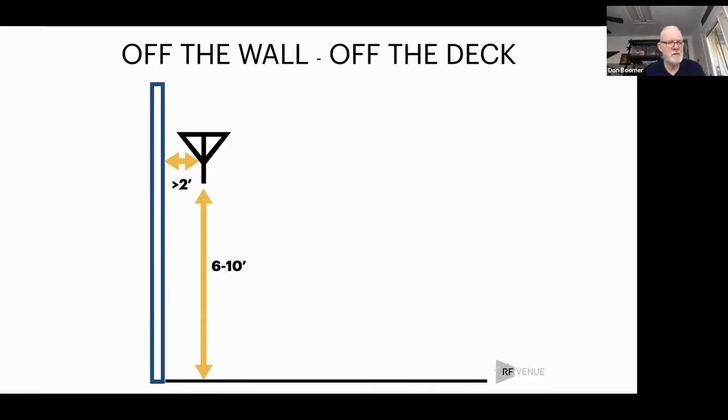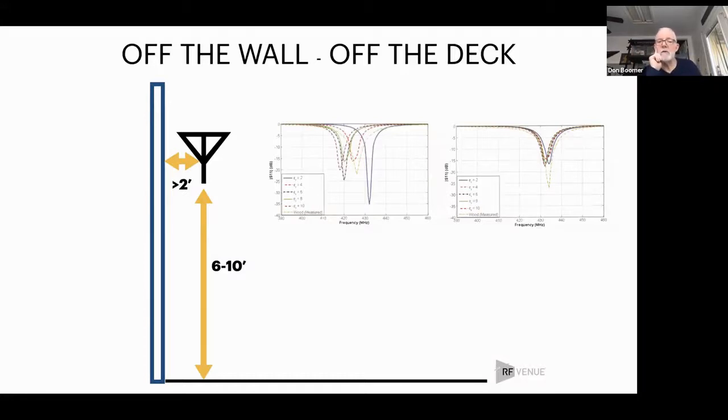The most basic placement for your antennas is six feet up off the floor, or a couple of feet off the wall. It's not always possible — sometimes you have to mount on a wall. If you have a directional antenna, it's not nearly as bad, but with an omni-directional antenna you're getting lots and lots of echoes off the wall. You don't ever want to put an omni up against the wall. What happens is you get multiple echoes off that wall and it detunes the center frequency of whatever you're trying to transmit.